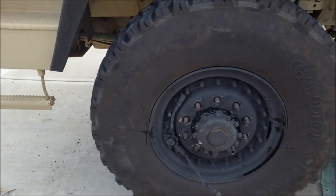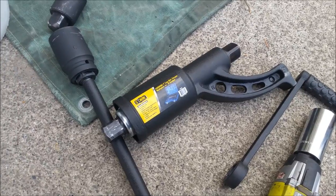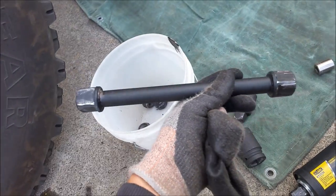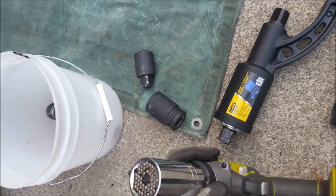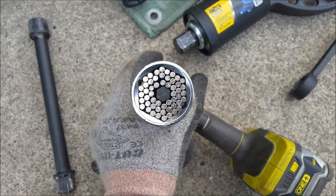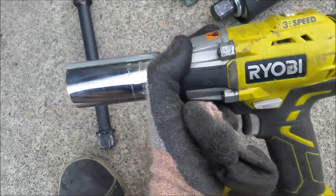All right, guys, I got all the lug nuts off. This thing is awesome. If you don't have one of these, they're about 60 bucks shipped on Amazon or eBay. They have various names. I just like the Stark one for whatever reason. But it comes with this aluminum extension, which I found works great with a 32 millimeter gator grip socket. This one I beat the living hell out of. You can see a couple of the needles missing. But it just slips on the end of that square drive. So once you get them loose, you can make the lug nuts fly off.